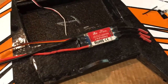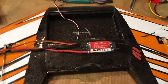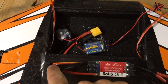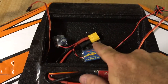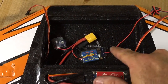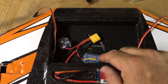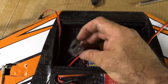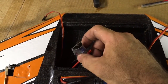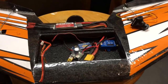The ESC is on — I mounted it with some Scotch Extreme Strong double-sided tape. I melted a hole through, soldered on an XT60 with two pigtails: one going to the UBEC, which will power the receiver and servos, and another going to the LC filter, which has two ports and will power the VTX and the camera.